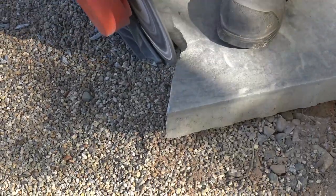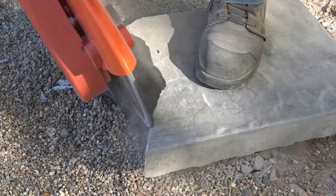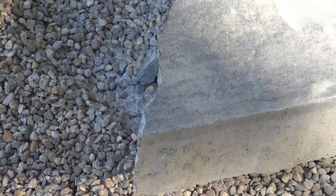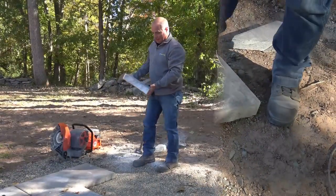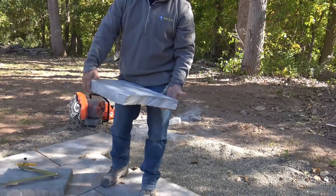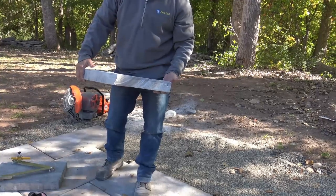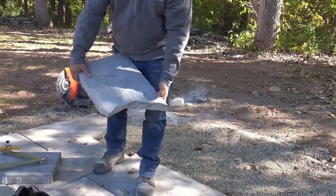Now I tip it up and you can see what that gives me. I've got lots of detail. People always ask about using a large cut-off saw — you can see, just taking a little bit of meat, hitting your high points, doing a nice deep undercut, that's how you can get that kind of detail on a saw cut.